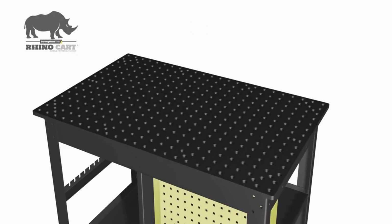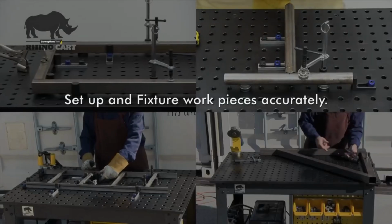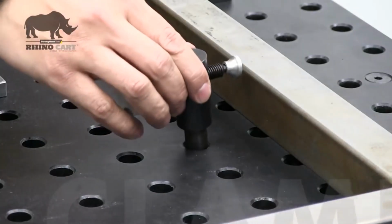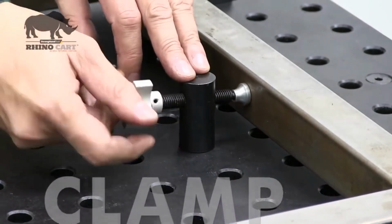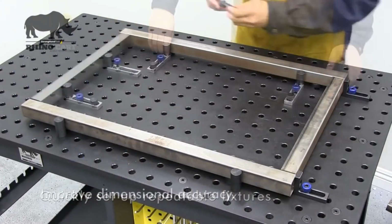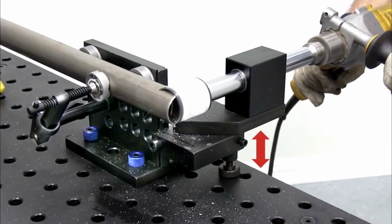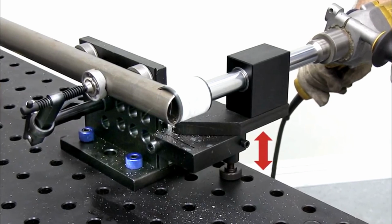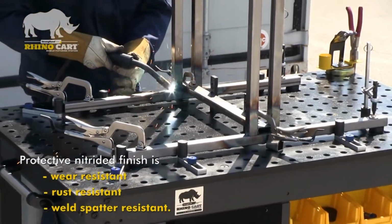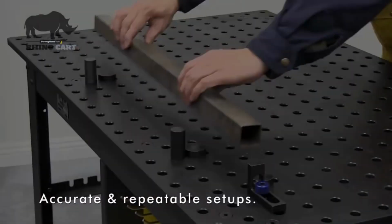The design feature of the welding station is a well-thought-out surface with the system of holes where metal guides are inserted. With their help, the work pieces are installed with great precision and if necessary can be fixed with clamps, which are also inserted into the calibrated holes. The fastening includes bushings, clips as well as spacers and cradles unified with calibrated holes. Each element of the fastening system is fixed by a spring ball latch under the surface of the workbench.